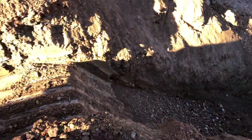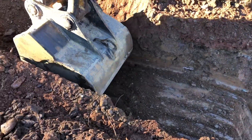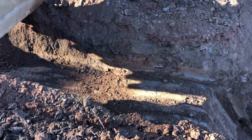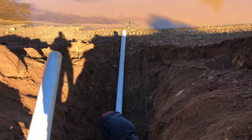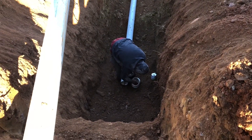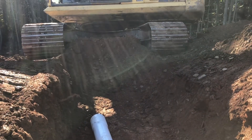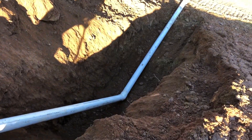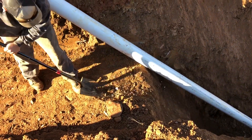We're getting it dug out so we can put in our siphon system. Right here is on top of the dam where we're dug down — this is where it's critical to get the pipe at the exact height you want so water will flow through the pipe before it gets up to your spillway and before it reaches the top of the dam. We've got a piece of pipe going out into the lake. Nathan's down there gluing in a 45-degree fitting that'll come back up to the trench. The siphon system will lay on here. Nathan's shaping it up so we can get the pipe leveled at the right angle.